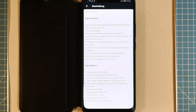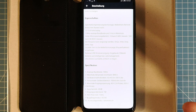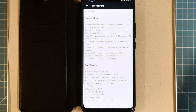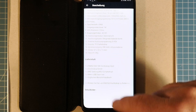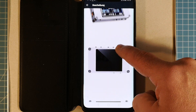It says that if you use a 10x probe, you can measure 40 to 800 volts. I would never put more than low voltage from a DC-DC or AC-DC converter into it — never. I won't play around with line voltage using this device.